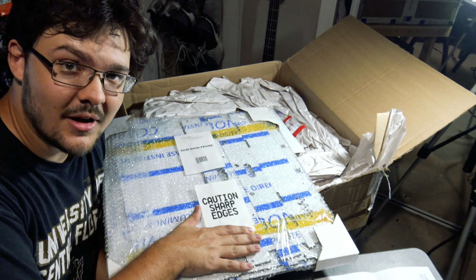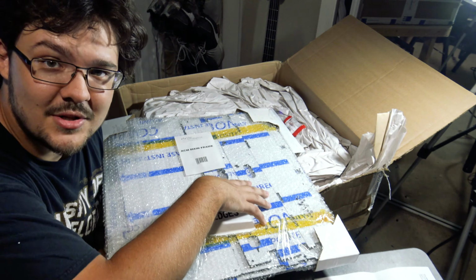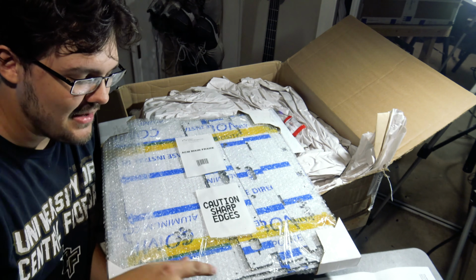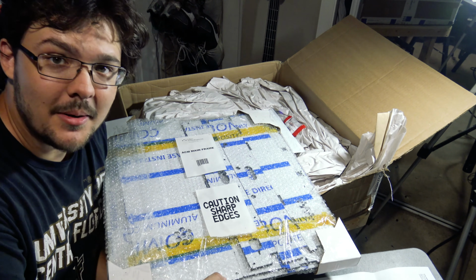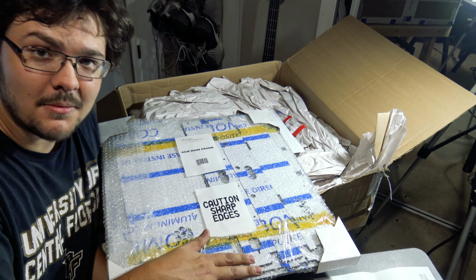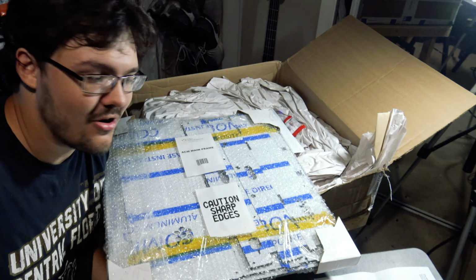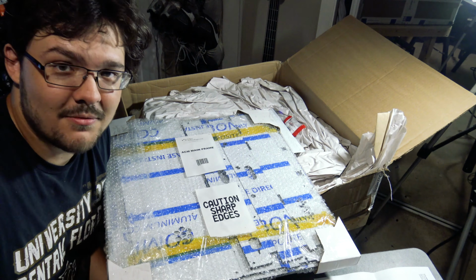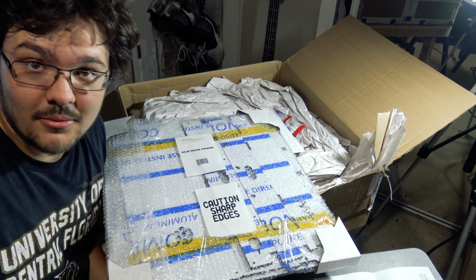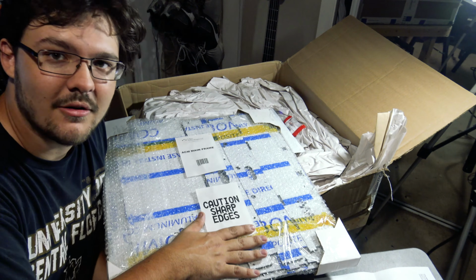So with this version, they have invested in big CNC mills and are using this material, which is ACM, which is aluminum composite material or something like that. Basically, it is a sandwich of aluminum on both sides and a composite plastic material inside. I got to play with this stuff when I was up at Folger headquarters, and it was very, very strong. This stuff is ridiculous. Obviously, it's not as strong as pure aluminum, but it's considerably cheaper than aluminum, it weighs a lot less than aluminum, and it is plenty strong for this application. It's a lot stronger than melamine.